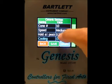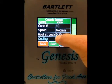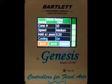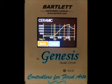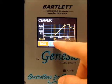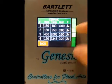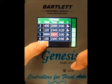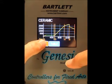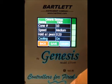Now let's see what happens when we press cooling and turn it on — press cooling, click on, save. Now we've turned cooling on. You can see that the graph has changed here at the end. If we press table as well, you can see that there are two segments added on to the end of the firing. Press back and we'll go back to the graph and back to the main settings again.